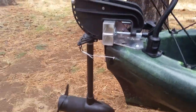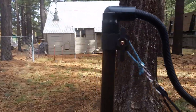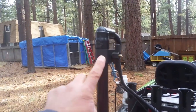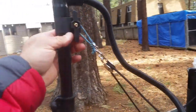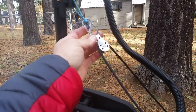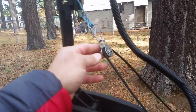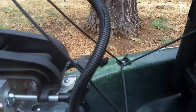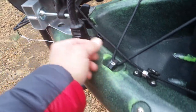The steering cables hold the motor down, and then here we get to my hoist system. Anyone wanting to use a Minn Kota and coming up with bracket ideas: this is a Yakima bar clamp that attaches perfectly to the shaft of this Minn Kota motor, and the only thing that bar clamp is doing is holding this loop of utility cord. I have a carabiner attachment so the motor can be removed — this apparatus stays with the kayak, the motor goes inside. I've triangulated the pull: this hoist rope goes down to a pad eye, comes up through this pulley, down through this pulley, and back to a Harken block cam cleat assembly.